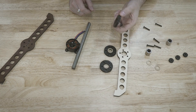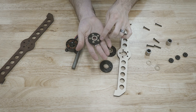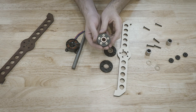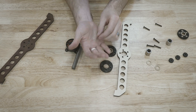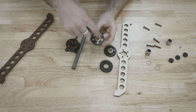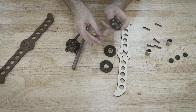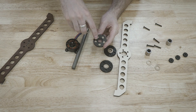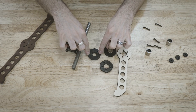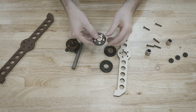This whole design is invertible, so there's really no top and bottom — but I'll call this the bottom plate. You see it has these threaded inserts; these are heat inserts, so you just press these in with a soldering iron. It's essentially the same thing I did with Anxiety Attack — these little ribbed or barbed guys that you melt into your hole. I also have one of these oil-lite bearings pressed into a little recess. This is a sixteenth of an inch thick, so 0.0625, and this recess is about 0.05, so it sits proud or a little high. When I set it down, you can see it rocks back and forth a little bit, and that is so that it can properly come into contact with another one of these bronze washers.